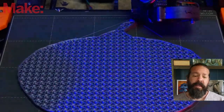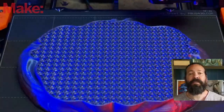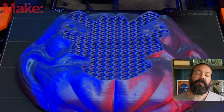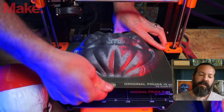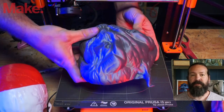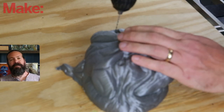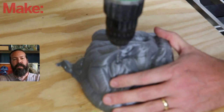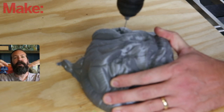After the sculpt is completed, it's time to 3D print. I've thrown it on my Prusa Mark III S and I'm printing it huge. I've cut it in half both for space and because my plan is to make a concrete mold out of this. The print came out absolutely beautiful — I love how it turned out. In this unfortunately blurry footage, you can see me drilling holes in the model so that when the vacuum former creates suction, the crevices have holes that'll suck the plastic down in.